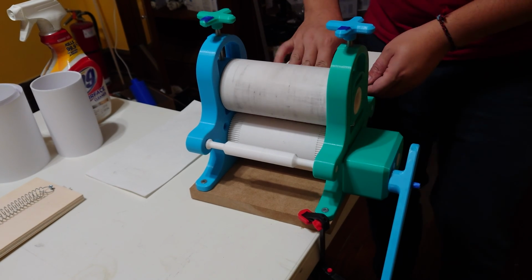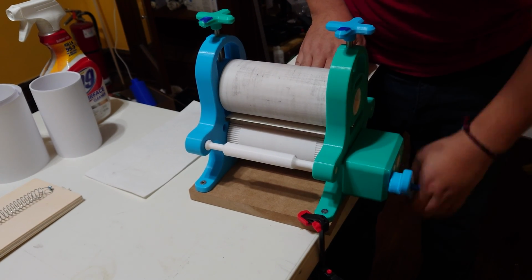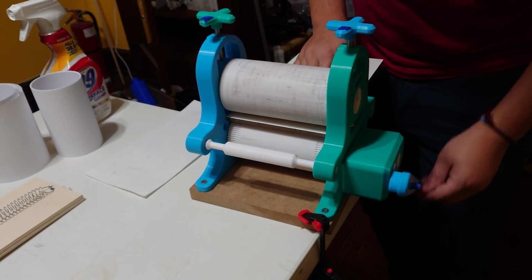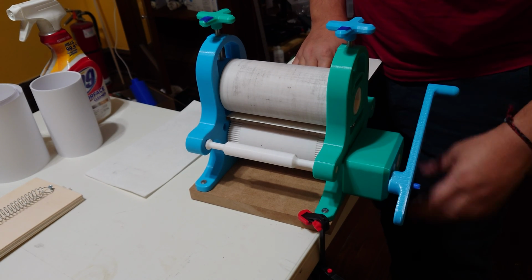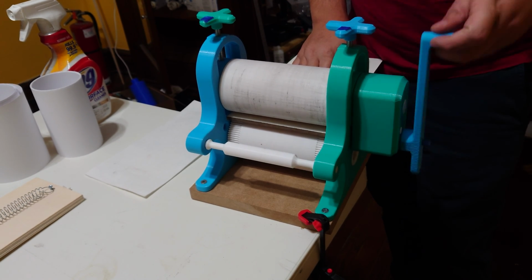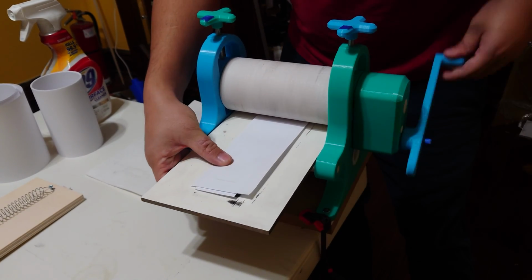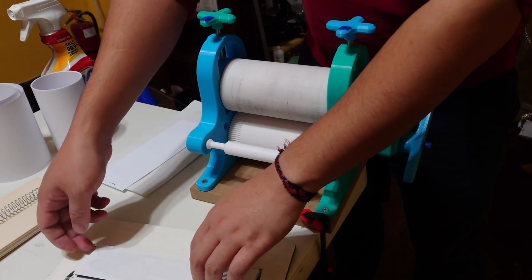As you can see here, the press has a really tight pressure and it's having trouble getting my artwork underneath that roller, because the bottom roller is pretty smooth and the bottom of my press bed is pretty smooth, and there's not enough friction for it to catch and bite. Larger, more industrial presses overcome this by having a really heavy press bed, but I just can't have a really heavy press bed unless I get a piece of steel or something like that, not at this price range. But now if I put it as a top roller, you can see that it easily catches and bites, because the friction of the paper and the top roller has a lot more grab, and so it's a lot easier for this process to get started and then just keep on feeding it through the top roller.